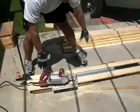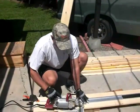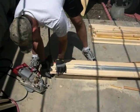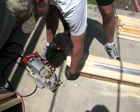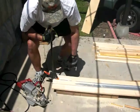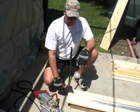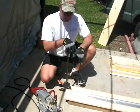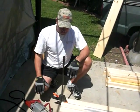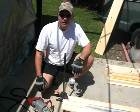I'm going to stop right here because as you can see I'm already starting to push this line off a little bit, and my cameraman is going to have to hold that in place. But as you can see we've made a 45 degree bevel cut — it's coming out right there, right on the corner. I'm not actually losing any material, I'm just cutting right exact to the edge. If you're using clamps like this, I do recommend you get the shorter ones that are only about 12 inches high so you don't have all this extra bar length hanging up — obviously this can be dangerous. That's it for bevel cuts. Thanks for watching — again, Jeff, simsamurai.net. Bye.